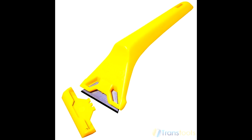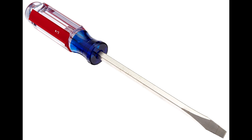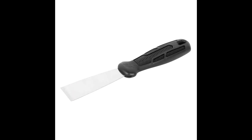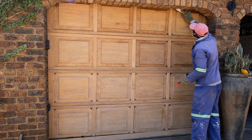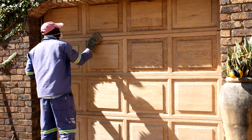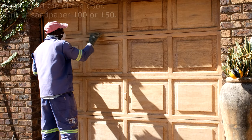So this is where it becomes a very manual process and some tools are required. Here are some useful tools: a paint stripper (sometimes called a window stripper), a flat screwdriver, professional scrapers with a screwdriver-type handle, and your general purpose paint scraper — sometimes filing it makes it a bit sharper. Then just go around scratching the final parts you couldn't reach with the grinder.